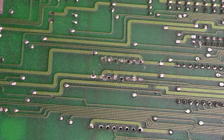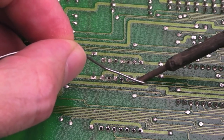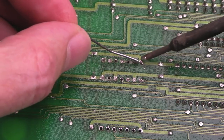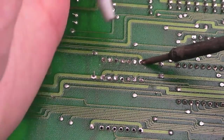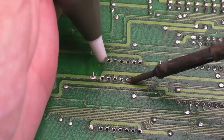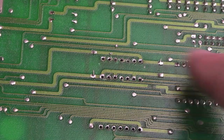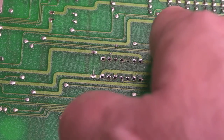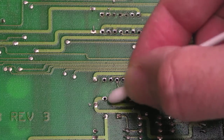You can see that's not too bad and the pads are looking okay there - we've got a socket on that one, it'll be okay. These ones are a little bit more mangled - I'm going to add some fresh solder. Some of these pads might actually be missing, it's hard to tell. I'll clean it with some IPA and cotton buds now, super carefully. I'm going to do that jumper next before fitting these sockets - I think we'll get the IDC connector fixed here as well.